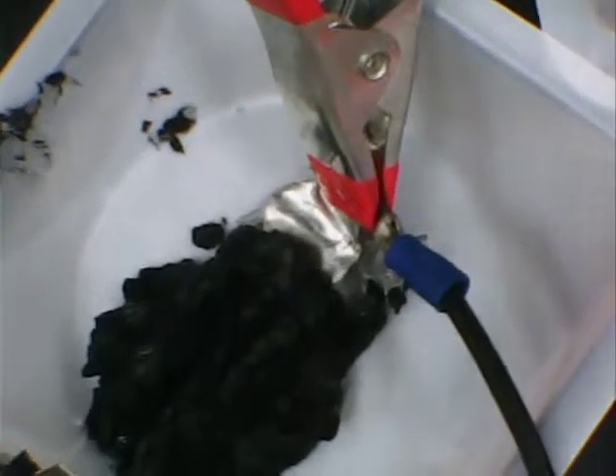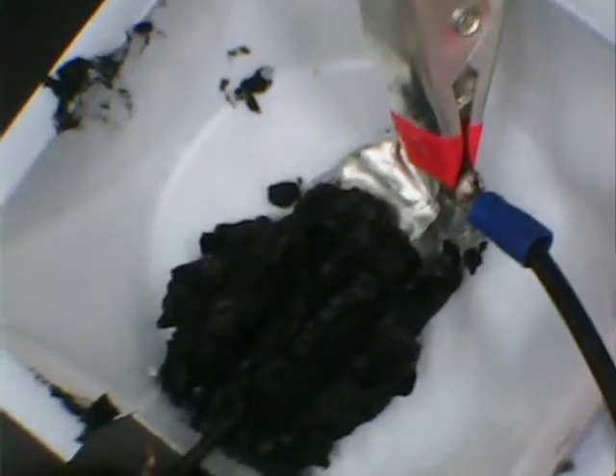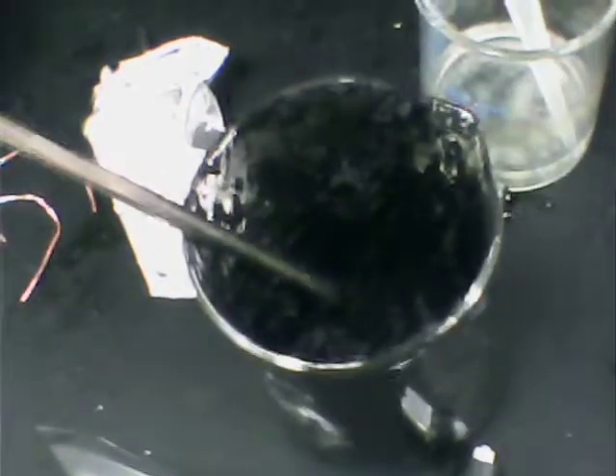That is then lathered with a paste that I make. This paste is derived from manganese dioxide, and that is mixed with a composite which is made from chitosan — insect exoskeleton chitin — which is hydrolyzed in this case to a very large degree to the free amino group, so it's chitosan.